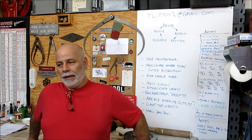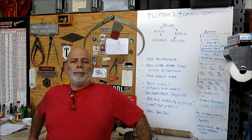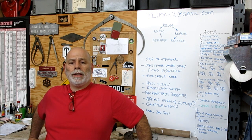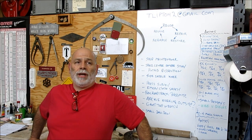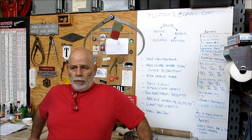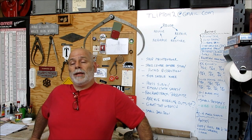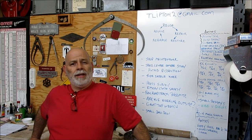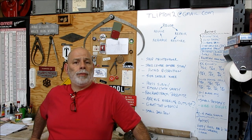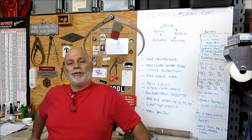So we did that, and I got some tool purchases that we're going to check out, and a couple boxes showed up. We're also going to pick up on this X-ray plug for Nick, the Energy Fabricator down in Australia. Mr. Chris Stevens in the UK correctly identified this mystery thread as a 3/4 26 BSB, which is British Standard Brass, I believe. And we were going back and forth trying to figure out what it was. Well, it turns out that it's a Whitworth thread, which is interesting for me since I've never actually cut a Whitworth thread. I've encountered fasteners, but I've never actually had the occasion to cut one. So we're going to grind a tool, and we're going to make this plug, and we'll do this 26 thread per inch Whitworth thread. I don't know, and I might have something else I throw in there too. So let's get an apron on, and let's get suited up, and let's get to it.